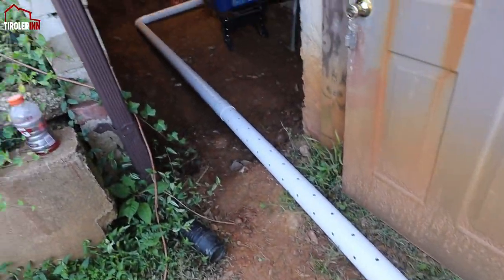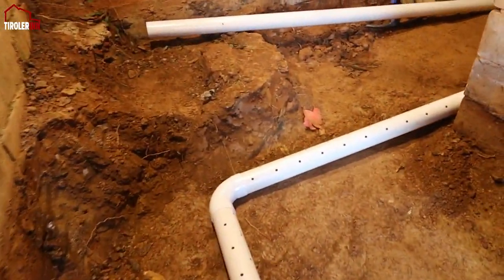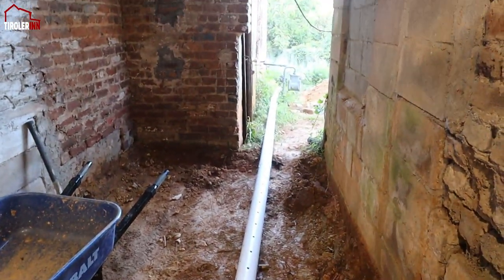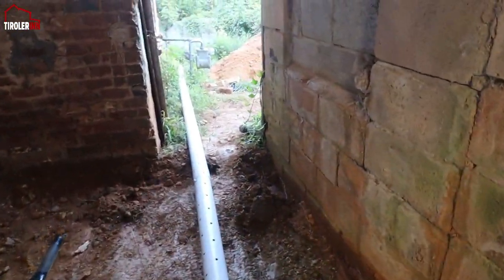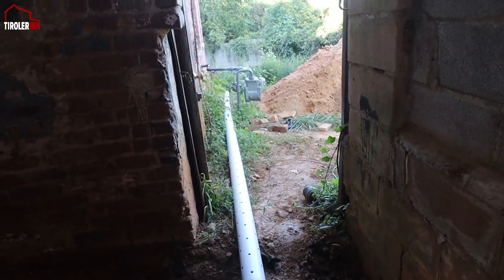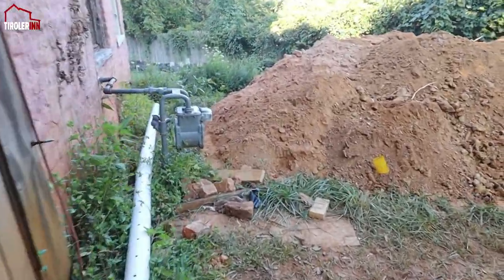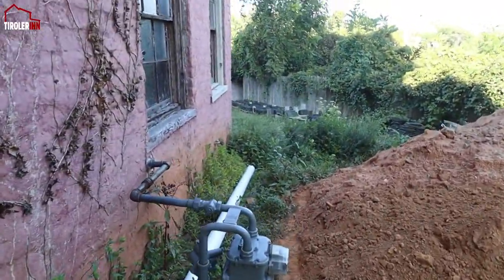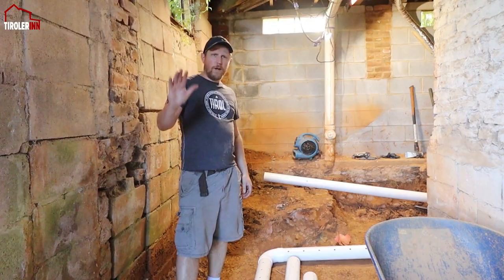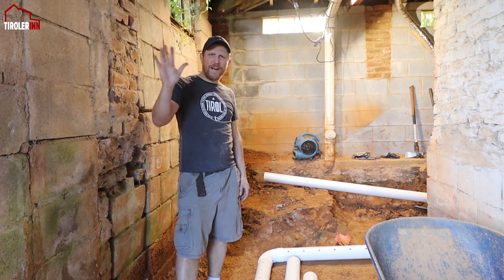Out here we'll keep digging, making the trench deep enough and with enough of a fall so the water can continuously run and not pool or just sit there. We want to be somewhat accurate with how we dig it before we put the gravel in to stop that from happening. Well, I think this is it for this week — I'll see you guys next time I turn on the camera. Have a good one, bye!